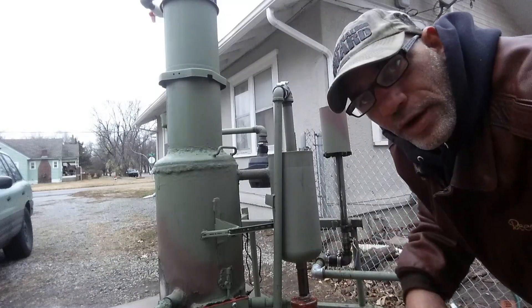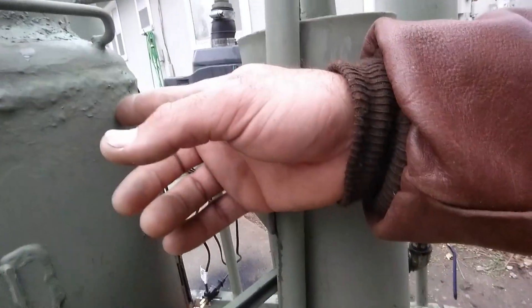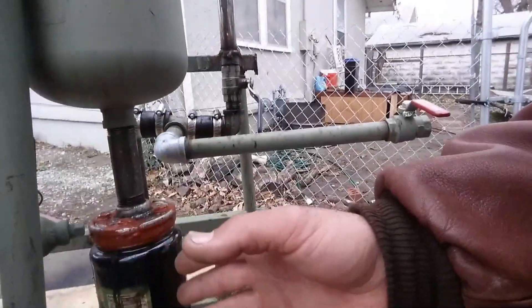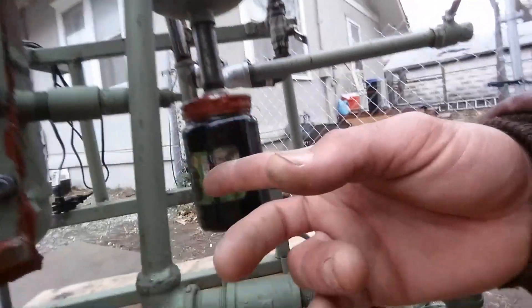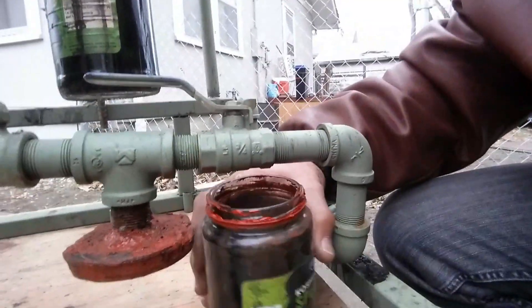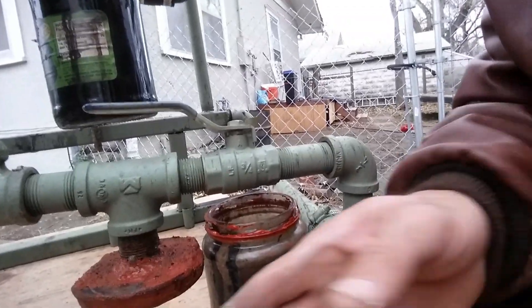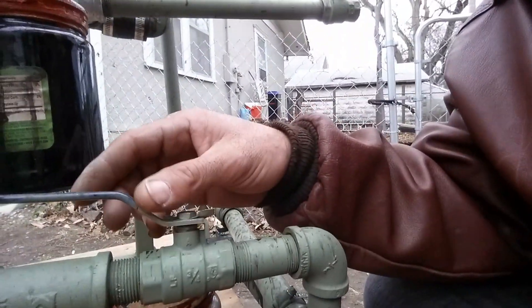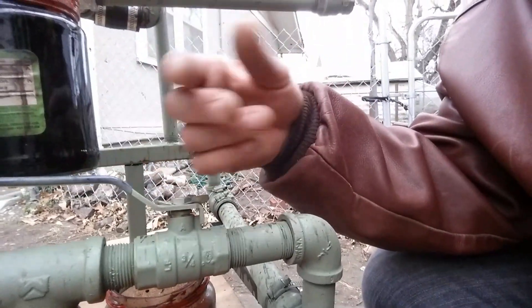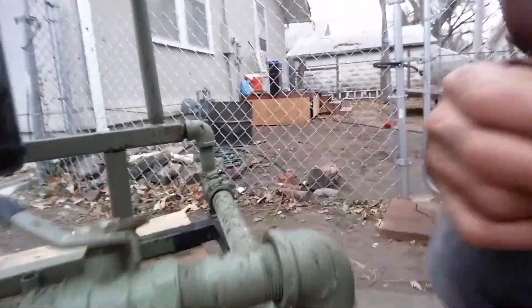As the smoke pulls from the reactor into the cyclone filter, it spins around, drips out tar and water, then gets sucked up through the pipe inside and comes out through this down pipe as cleaner gas. I've added a secondary drip jar here as well. I've also added a control valve so I can limit or fully open the amount of gas pulled through, adjusting it to whatever makes it run best.